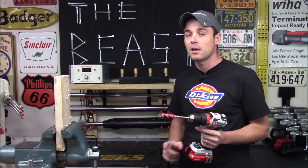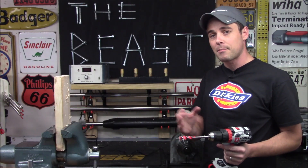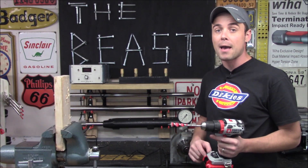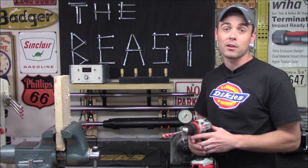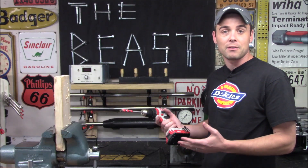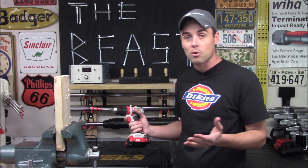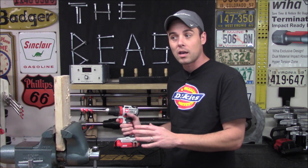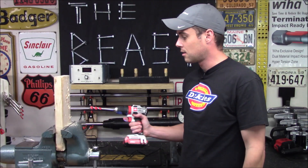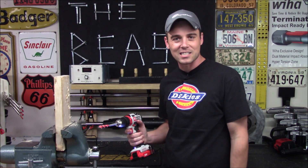If you're going to take the risk of trying to revive a lithium pack after your charger refuses it, make sure you're outside. If you don't feel comfortable doing this, turn the battery in to the manufacturer or send it out for recycling — it's a lot cheaper to just buy a new battery pack than to risk burning your house down. In this case, we were able to save roughly 50 to 100 dollars by reviving this pack and getting right back to work without going to the store for a replacement. If you like this video, please click like; if you like my channel, please click subscribe.